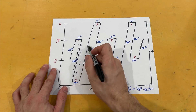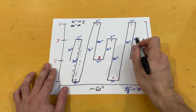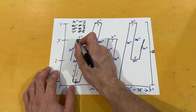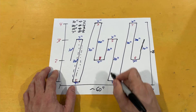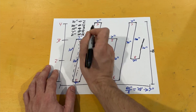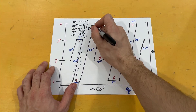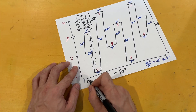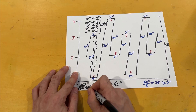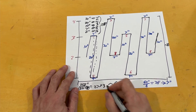Now to calculate how much wood I need, I'll add up the segments. There are two 30-inch segments, four 20-inch segments, three 10-inch segments, eight 7-inch segments, and then 16 2-inch pieces that I will use on the back of the build to connect the segments together and protrude the build from the wall. If I total these up, I get 258 inches total. Often the wood pieces are sold in lengths of 8 feet, so if I divide 258 inches by 96 inches, that is 2.7, which I round up to calculate that I will need to buy three pieces of wood.